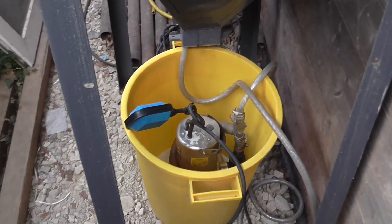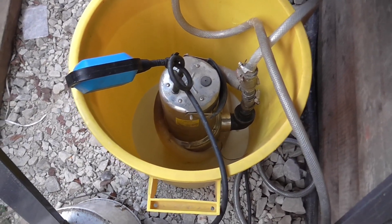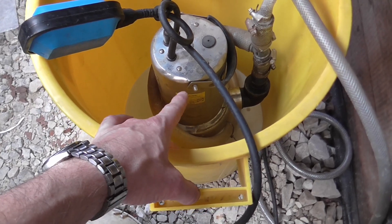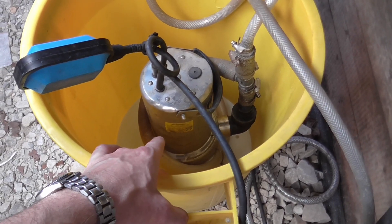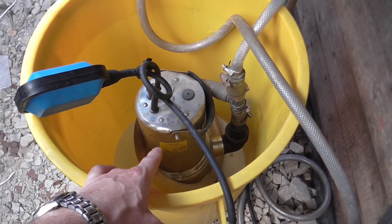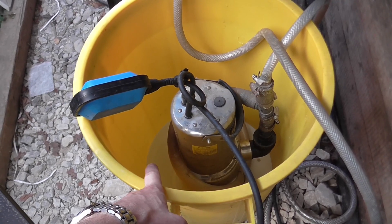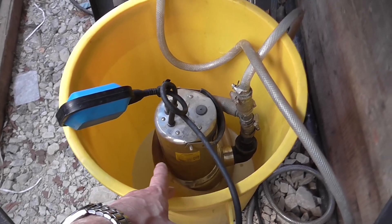The secret of a vapor blasting setup is what's in this bin underneath the cabinet, and it's really very simple. This is a dirty water pump — a cellar pump or sludge pump. It's designed to be able to pump solids up to about 30 millimetres. A lot of them say not to be used with abrasives, but glass beads really aren't that abrasive — they're basically spheres. If you were using it with aluminium oxide then yeah, the pump might not live very long. This is a stainless steel pump.